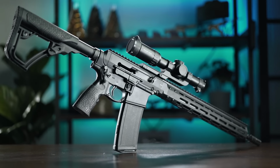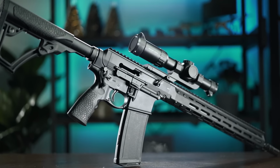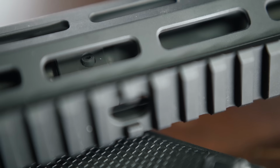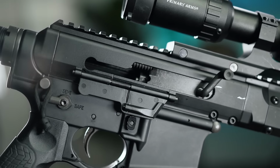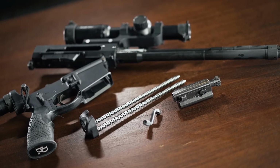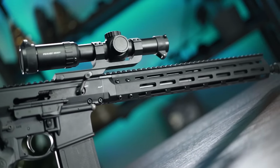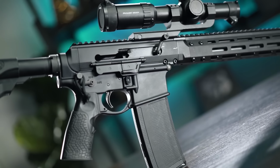The folks at Brownells set out with a very simple goal, and that's to bring the AR-180 to the modern market with as little redesign as possible, while making it functional with existing AR-15 platforms. Using the same short-stroke gas piston system, reciprocating charging handle, quick detach handguard, and captured bolt carrier group and bufferless design, the BRN-180 hits all of the high notes of the OG AR-180, while remaining fully functional with your existing AR-15 lower receiver rather than replicating the proprietary design of the original.